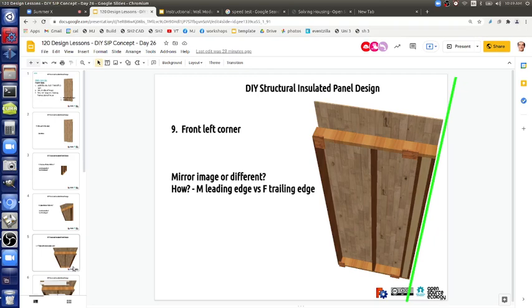Was it ever argued to make your space on the concrete a little bit wider, even though it wouldn't be a common measurement, in order to truly make every panel the same? That was argued. You're going to get into trouble. Then you have to expand the second story platform, which is made of 4x8 sheets, so it ends up being 32x16. Gotcha. Some part has to be irregular. We decided to keep everything standard for the house itself being 32x16.